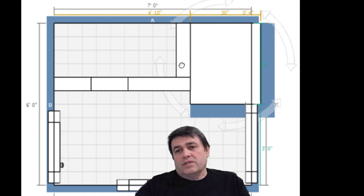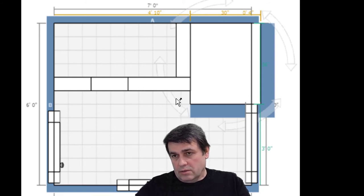All the water supply runs inside this wall because upstairs I have a washroom, so it's pretty easy. I switched the regular door and I'm going to provide a pocket door which opens on the left side — that'll work perfectly. Of course I have to provide light inside, and also a hidden supply duct, because our duct in the basement runs close to this direction and I can supply extra heating for this little washroom.